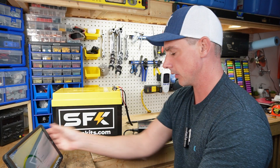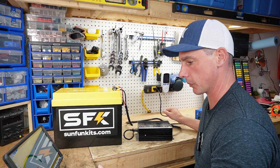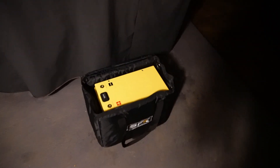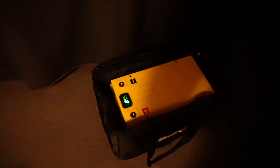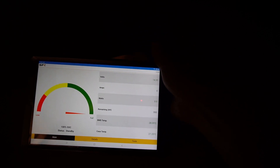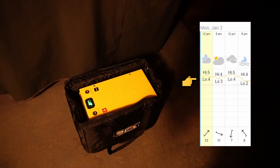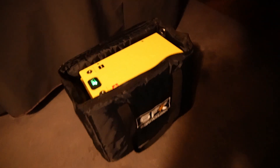The battery is fully charged — just going to top it up a little bit before we start the test. The charger kicked off. I'm going to do an overnight test with the battery at 100% charge. I'll turn it on to setting number one — it won't show any discharge right now because the temperature is above 27-28 degrees — but tonight the temperature is supposed to go down to five degrees Celsius, about 41 degrees Fahrenheit, and I'll leave it inside its case all night to see how many amp hours remain tomorrow.